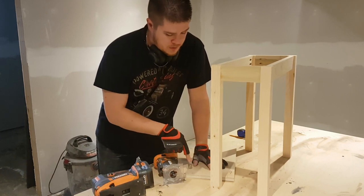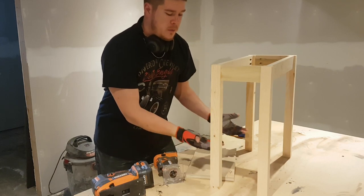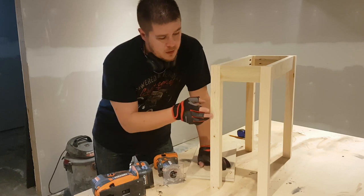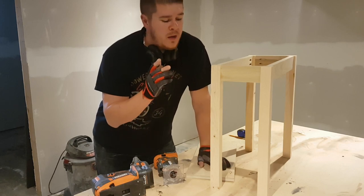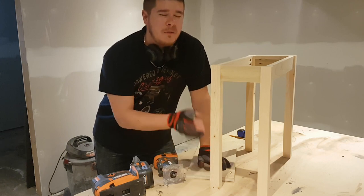After that, I'm going to put a pocket hole on each side of every corner, and that way it'll be able to fit up and I'll be able to suck it down and snug it up tight in between the legs. Speaking of my legs, you guys may remember when I built my other pieces for my friend there, I had a 45 degree chamfer on all the legs.